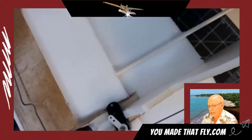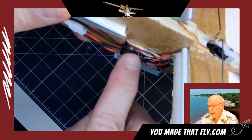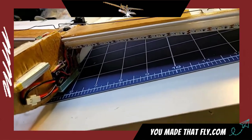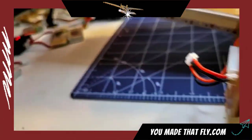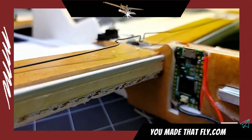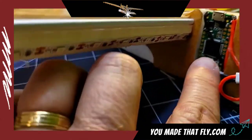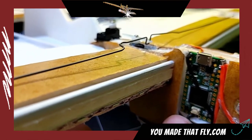And what we did is that we took off the controller pin here. We took a black wire off the extra plug. Now one wire goes to the light. Because it's a change in voltage on the extra pin, we just took the black wire off and put it over to a pin of the Teensy and then did programming with the Teensy, so I have the power. It's just straight up to the power here. And all I have is just one wire. And you can have it to any pin. We just happen to have it to pin 3 on the Teensy. And we'll go over that in a second here.